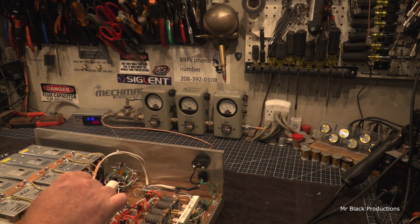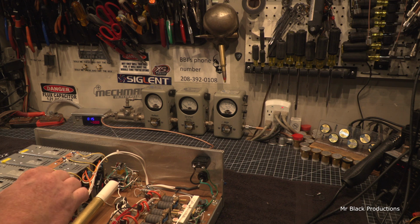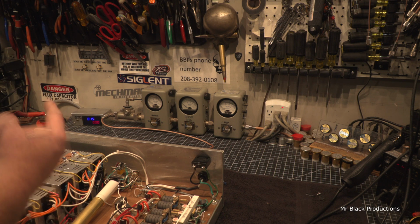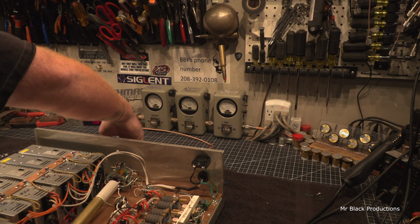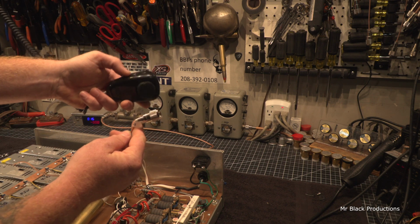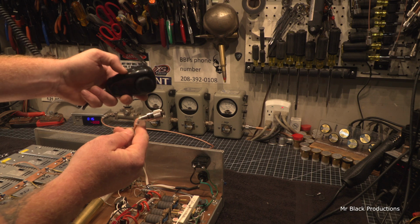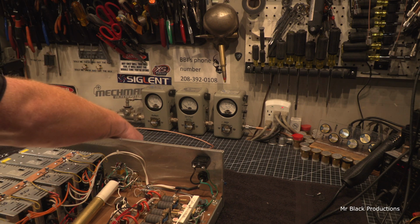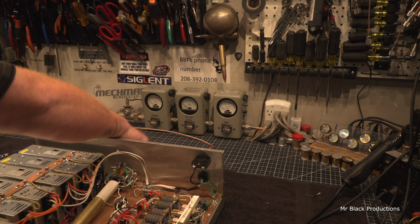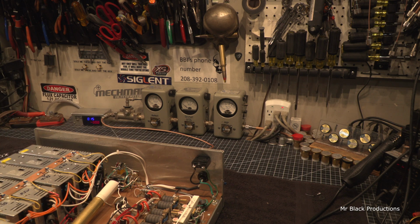Every time I put some balled up piece of junk on my workbench and I go to key it up to test it, and it has a high SWR above like 2.5, it blows the finals out of the radio. Or this thing, I can... It hurts nothing. Hurts nothing.